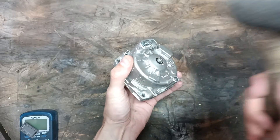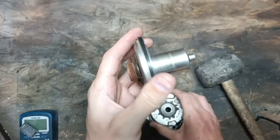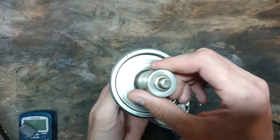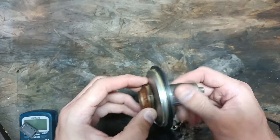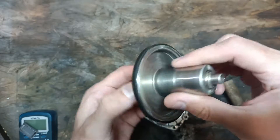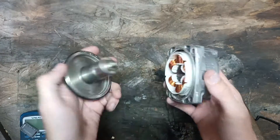Just for information, I'll show you how to remove that. You just give it a whack there with a rubber mallet and you can get that out. This is what seizes in here — that seizes. That screw is not moving; you have to push the screw and then do it. So that's how you would unseize it — you put a screwdriver through, and you could do it through the body while it's on.